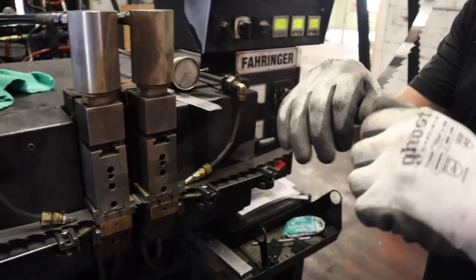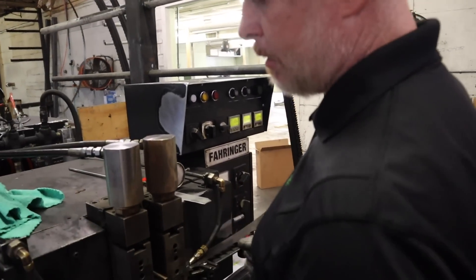If you don't do that annealing step, it'll become very brittle — it'll be a real brittle weld.